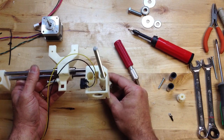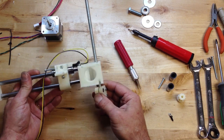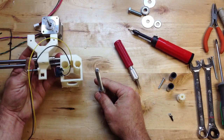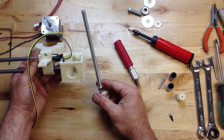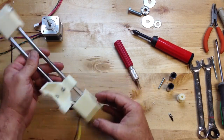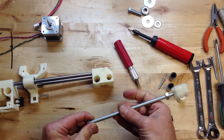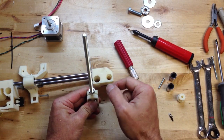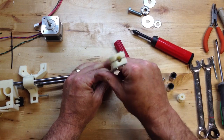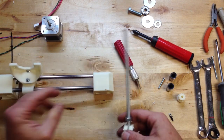The real benefit — aside from being hard to align the motors — is if you leave that off: even though it's not coming loose, it's pressed in there, when you want to pull that X carriage off you can just slide this whole thing off and it'll come off your bot. You can work on it, adjust something, grease these down, whatever you want to do. So that's how I run them — I usually leave this out, and then I put this on here because it's a lot easier to screw that nut down on your threaded rod than to twist it all the way down when you do get ready to mount it. So that's a little tip.